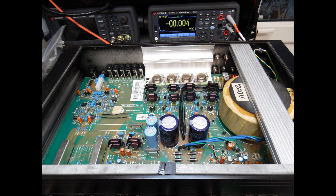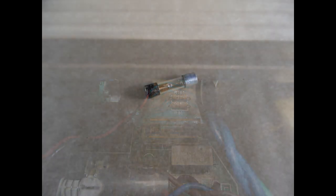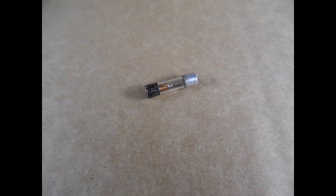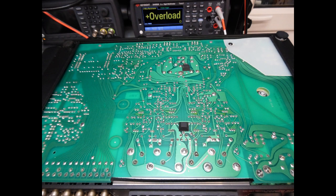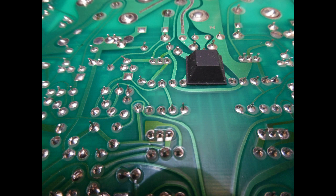So what was the issue when this amplifier arrived? First off, it didn't power up, and that was due to the internal fuse protection having failed. Normally when you get a fuse protection failure it indicates that there is an issue with one of the electronic components drawing excess current, and that was the case here. From a service point of view you remove the top cover and two screws at the rear to remove the bottom cover, giving you full access to the solder side of the board. Checking the output transistors was very straightforward.